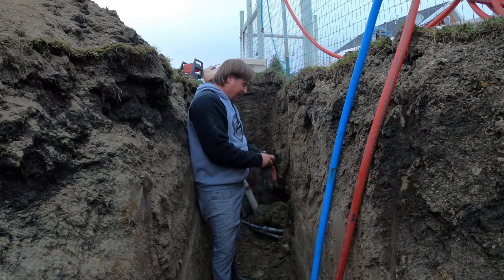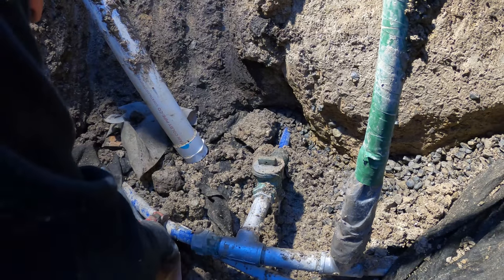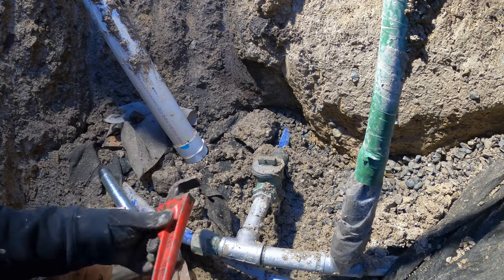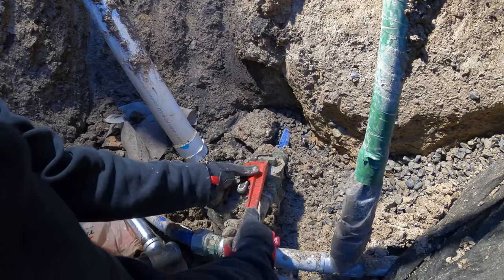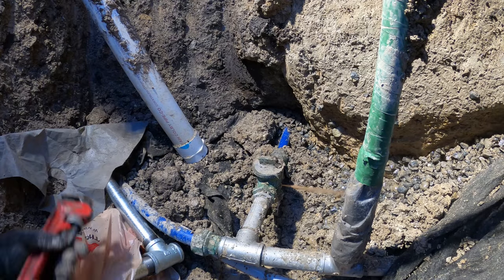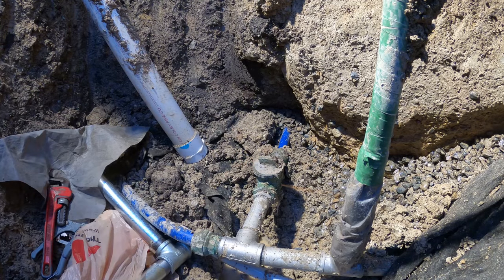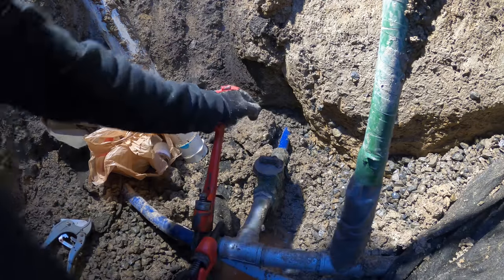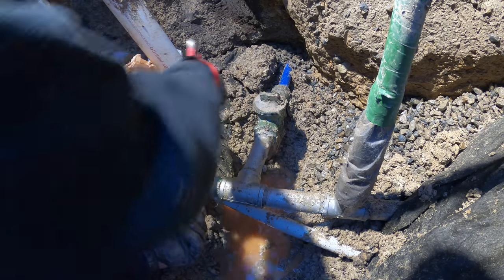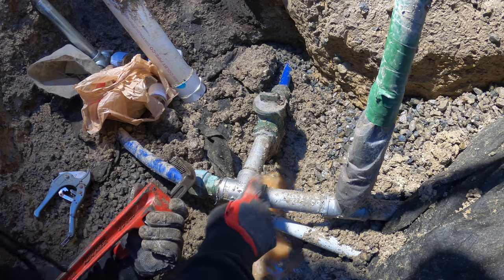First thing I've got to do today is clear out all this soil that's left off here. Here's my main line going into the house right here — this is a shutoff valve for a future supply with a stop-and-waste valve on it. I need that to drain. Look how nasty that is — all that sediment in there. I've got to put a new fitting here, new here, new here. This is going to be full of water.